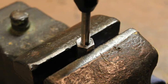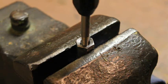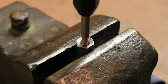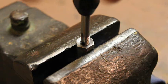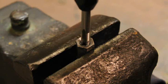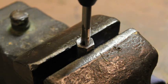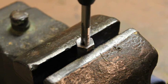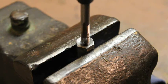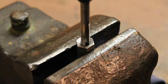If the tap continues to cut as it gets deeper, it should be carefully backed out and the stud re-examined. This likely indicates that the tap was not lined up properly to begin with and is now cutting up the good thread, or that the damaged section of the thread is larger than initially thought. In either case, the stud is probably too damaged to be repaired properly and a new part should just be ordered. After backing the tap out and blowing out any metal chips left inside, the repair job can be checked by gently screwing a stock bolt into the stud. It should thread in easily, and while it may feel a little loose in the repaired threads, it should be held securely by the undamaged threads once it's all the way in.